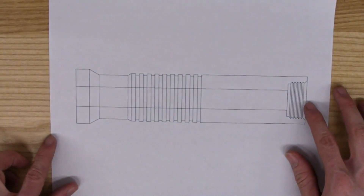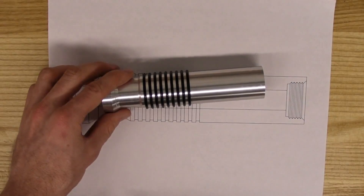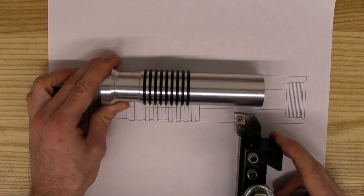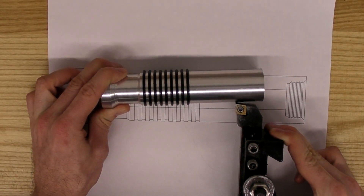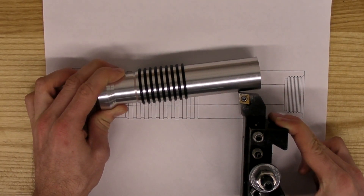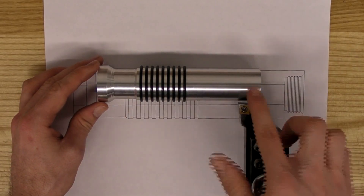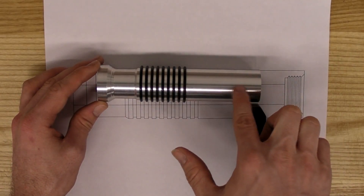There's no one right way to manufacture a part like this, but there are some good rules of thumb. During machining, we often approximate the part as having a fixed geometry. But in reality, no material is perfectly rigid, and the stress of the tooling process will always cause the part to flex by a small amount. This leaves a thin layer of material behind and makes the part slightly larger than indicated.